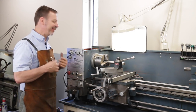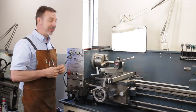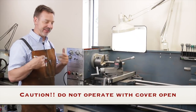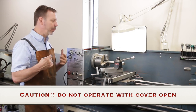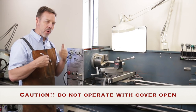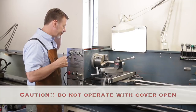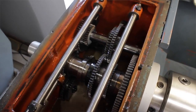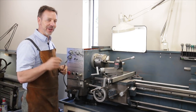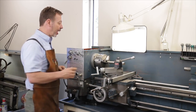So I would say this isn't a very well-designed transmission, but it still works quite well. Challenges with transmission is there's a lot of gears inside here, and as we run a speed test on it, we want to be very cognizant of hearing grinding or clicking sounds. Now when you open up the top of this, you'll look inside and you'll manually rotate this, and you're going to look at every gear inside here and study each tooth. You're going to make sure there's no teeth missing or any strange marks that would say there's a problem.